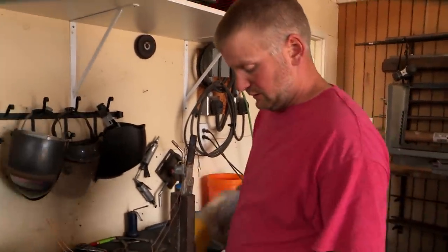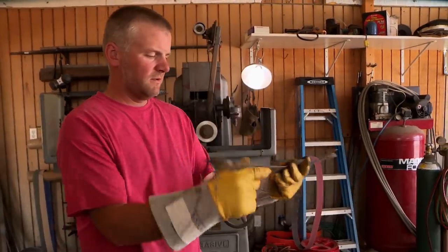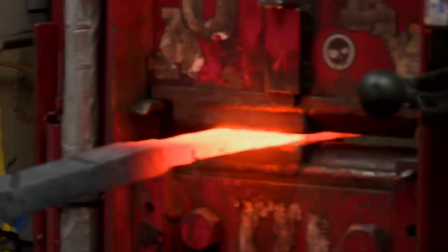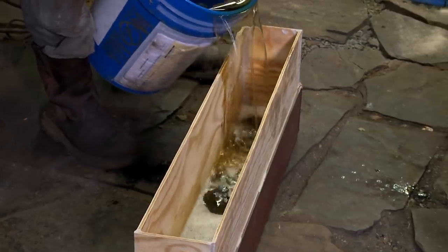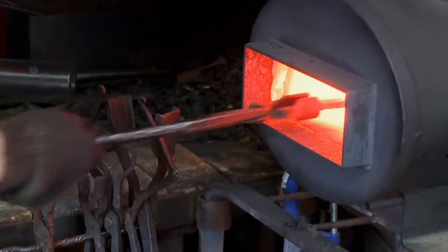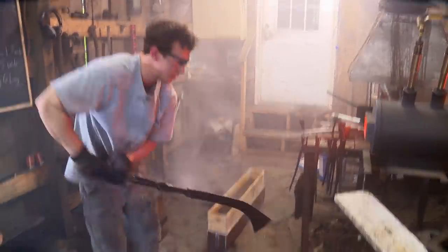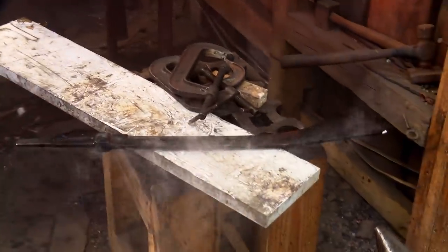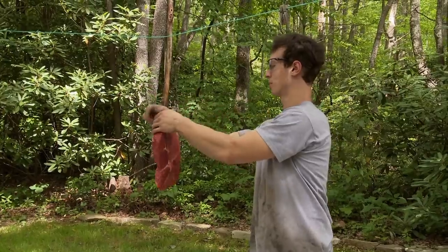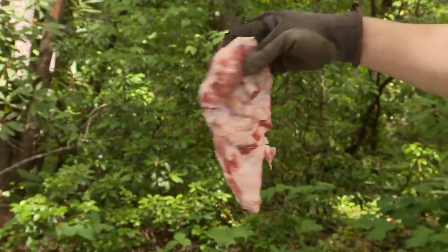Seems to be hard. You heat treat and grind an edge on a sword based on what it's going to be used for, and I don't know what it's going to be used for — that's the problem. Today I'm going to do my heat treat. Unfortunately I don't have a heat treating oven large enough, so I'm going to have to do this in the propane forge. This sword is at least twice as big as I'm used to — I would not normally heat treat something like this. Hopefully it heats up evenly. Going for the quench. It's perfectly straight, it's really hardened, and now I'm going to sharpen it. Worked pretty good — Josh better bring his A game to beat this.